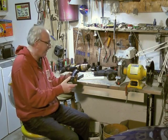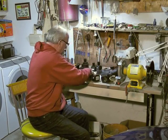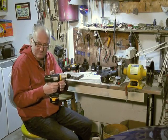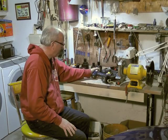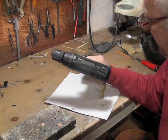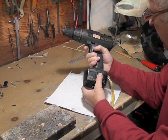Hi there again, it's Willie D. I was looking at all these drills that have basically been given to me - just look at them all, one after the other, none of them work, all the batteries are dead. People are giving them away, so I want to show and have a go at putting one of these drills to main power - removing the batteries and putting it into main power - to help anybody else that wants to do this. Here's a 12 volt Craftsman drill, batteries not working, so we're going to convert this.